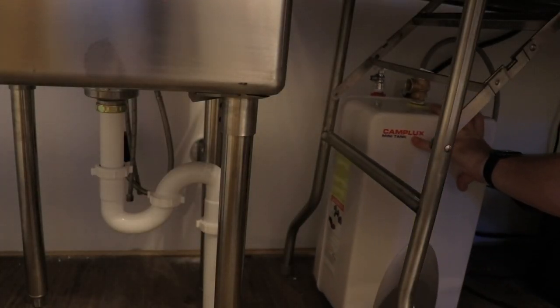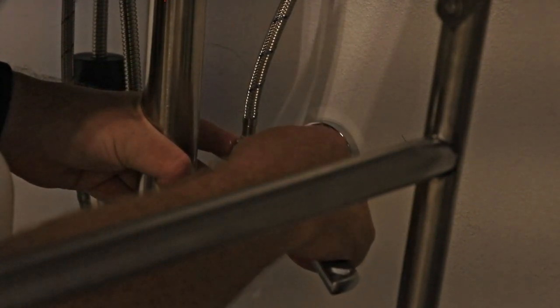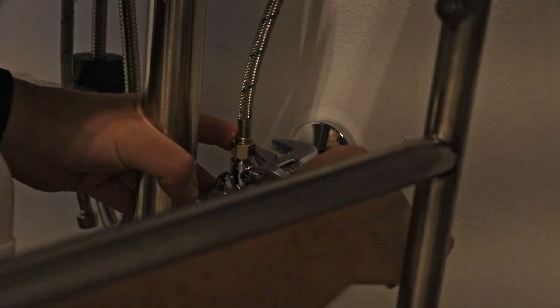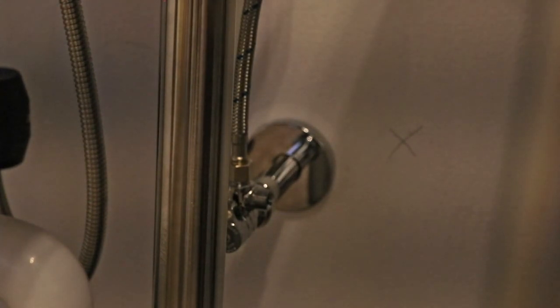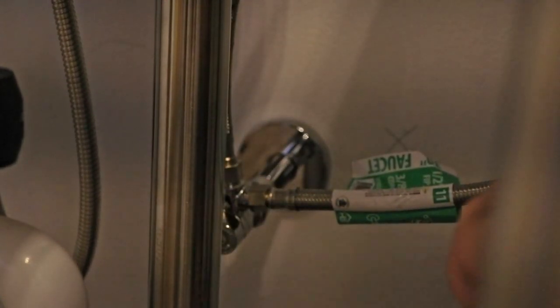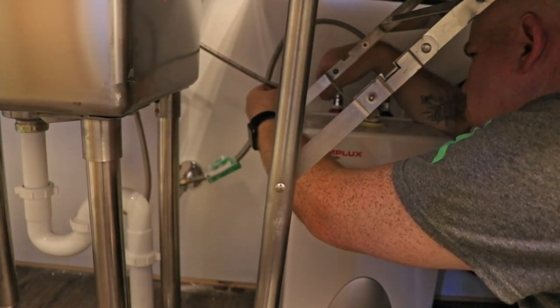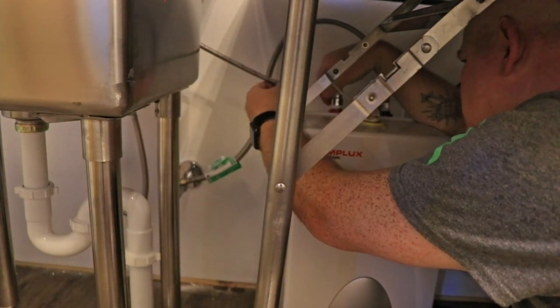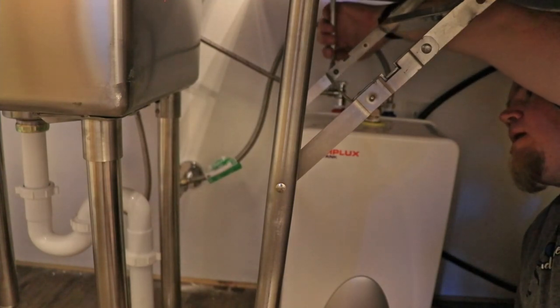Now we just need to slide the water heater in place. You can mount this water heater on the wall — I chose not to; I just chose to have it sit on the floor back underneath my table. I'm connecting the water supply line that runs to the water heater off of the cold splitter. That was actually the cold water running to the faucet; this line is running to the water heater right here, and that's the hot water line. I do end up moving the water heater a little further left so there's a little more slack in the line, and I'm snugging it down with a wrench so we don't have any leaks.